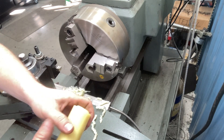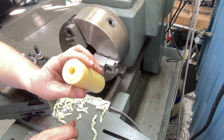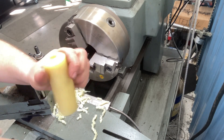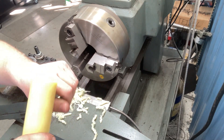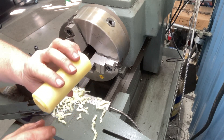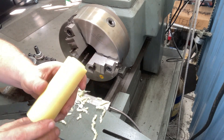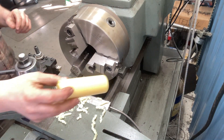The only thing that can give you trouble with nylon is when we're drilling - we're gonna have to be very careful because it likes to heat and then pinch the drill, and it will try to suck your drill further into the work. So what I actually do is keep my hand on the tailstock lock. The quill will feed in and then all of a sudden I'll retract the entire tailstock before it begins to grab at the drill, otherwise you can have trouble.